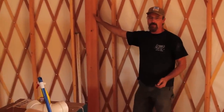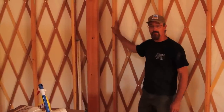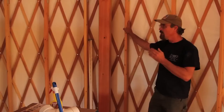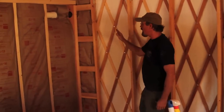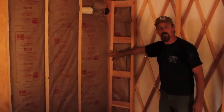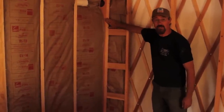That's typically what we do, especially in yurts that don't have a snow and wind kit, like this yurt does. That's why it's a nice opportunity to check out a couple kinds of framing, because right back here toward the back of the kitchen, they've gone ahead and tied into the structure of the yurt by putting some sleepers in between the snow legs and then putting the first stud for the wall up against those sleepers.